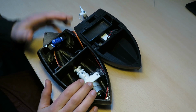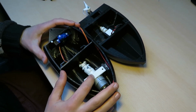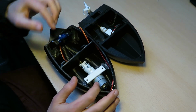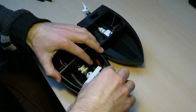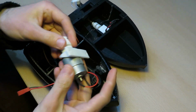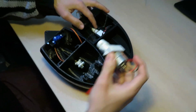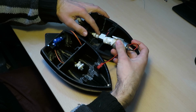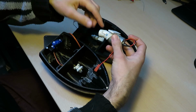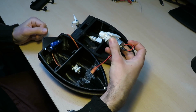motor at the front. In addition, I made the space for the motor much larger, and instead of designing a custom space for a specific motor, I'm just using these two mounting holes so I can use any motor provided I print a bracket for it. The coupling is also different, so instead of using one that is glued to the shaft of the motor, I'm using one that can be screwed on it, so I can easily take things apart.